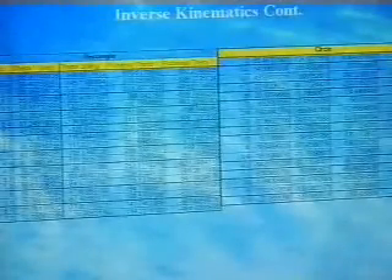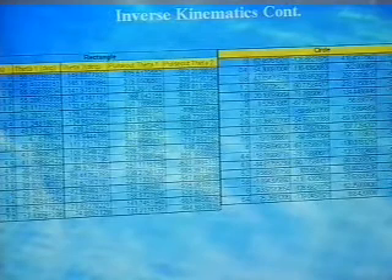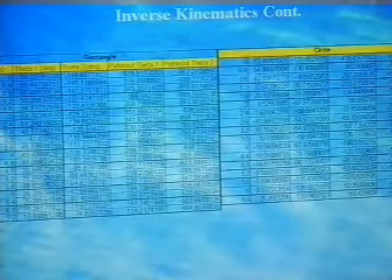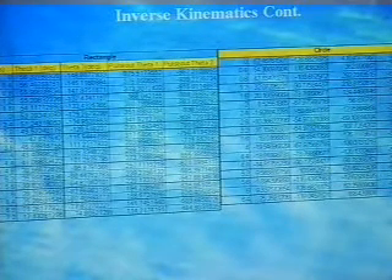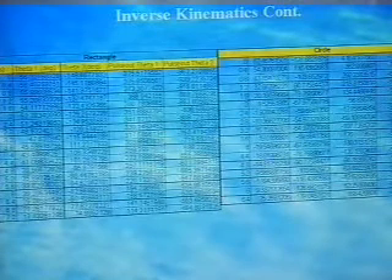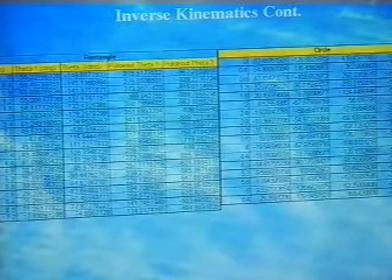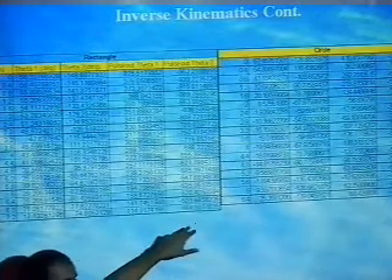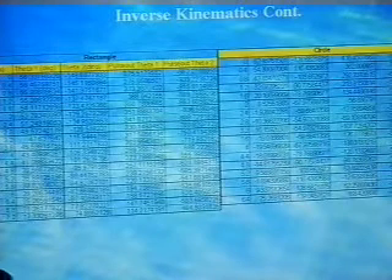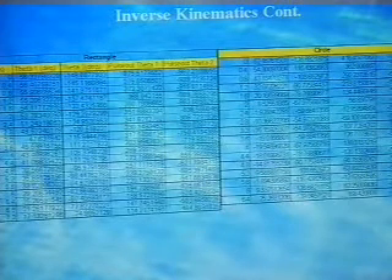The reason I'm showing this data is that our design intended to use inverse kinematics to compute Theta 1 and Theta 2, and from those determine the pulses to send to the servos. However, that wasn't the case — we had to do it manually. The numbers didn't make sense because the servo ranges are from 250 to 1250, but when we tried them we had to align them, so the numbers were different. The theoretical values were over the limits, so we had to manually pick each point and play with the arm motion until we reached it, then register the pulses for that specific point. The process was tedious, but it was the only way we could do it.